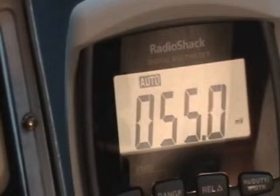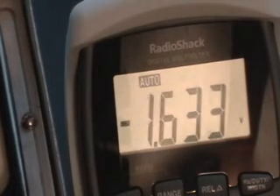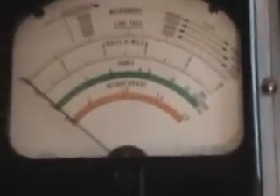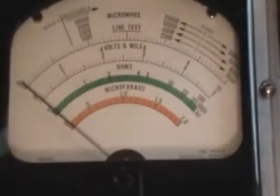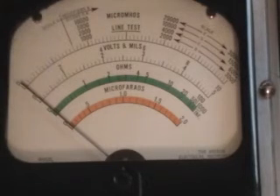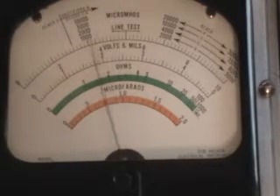The first thing I'll show is a regular 1.5-volt battery. I'm now showing my digital meter just to show the accuracy — it's a brand new calibrated meter. You can see 1.6 volts. Now panning over to the tube tester meter, we're on the 5-volt scale. We should end up right in this neighborhood — and there we have our approximate 1.6, probably even closer to 1.8 DC volts.